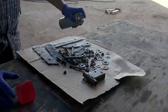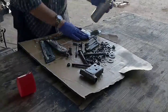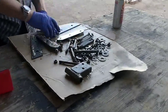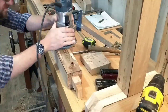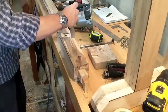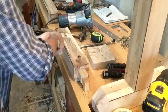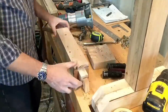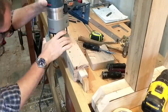I've removed the pieces from the vinegar bath. It's important to immediately rinse them, dry them off, and coat them in oil — they rust incredibly fast if you don't. Here I'm doing a little routing on the pendulum brace. The way these metal straps attach, the ones from one side will overlap the ones from the other side, and I don't want them to stick way out, so I'm recessing the straps that go on one side of the brace where those attach to the pendulum.